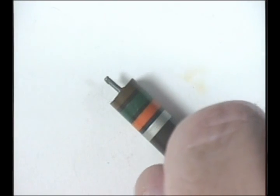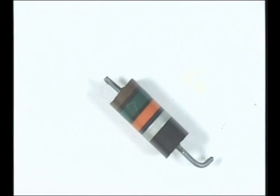Here's a resistor — this is a carbon resistor. It's packed carbon. They used to get carbon off what they called lamp black — scraping the black residue from the inside of a kerosene lamp — and compact it. Carbon has resistance: it allows current to flow somewhat, but not as well as a pure conductor. I want to pass this resistor around and let everybody look at it. We're going to talk about resistor color codes in a little bit.